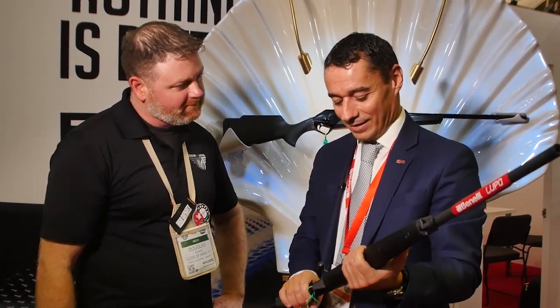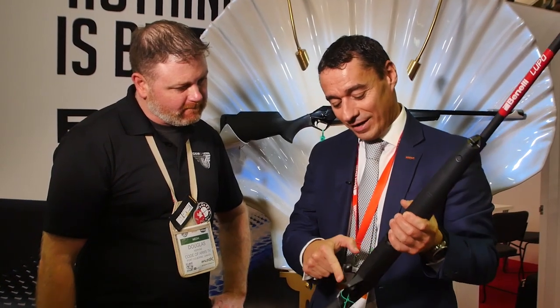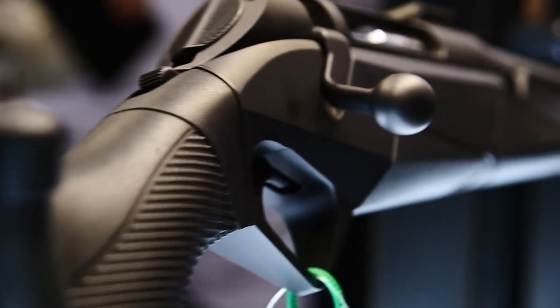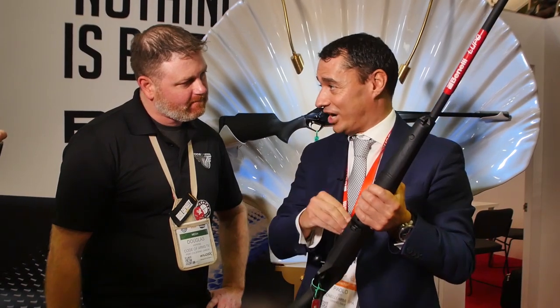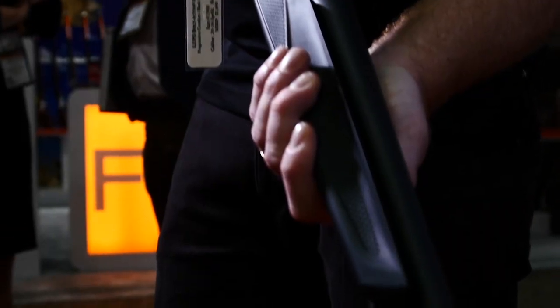You are the plant manager in Italy — tell me about the quality control at Benelli. We have a lot of control in the Benelli style. We produce the receiver on a special five-axis machine, 100% controlled, starting from raw material. The trigger guard is completely integrated with the receiver as one solid unit — not plastic, aluminum alloy, very strong. Production is 100% checked with automatic machines after production — all pieces. And it's 100% produced inside our factory.